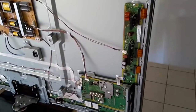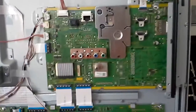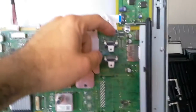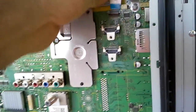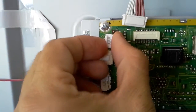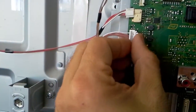To get to that board, take it out and either repair it yourself or send it to us for repair. You'll have to remove the main board first. The main board is removed very easily — just take four screws out — but first disconnect all cables going to it. Press and pull up on this one. Some connectors you open by turning 90 degrees with your fingernail, then gently shake and pull. Others are pressed and pulled towards you; others are pulled sideways. Press and pull towards you for the first and third type.